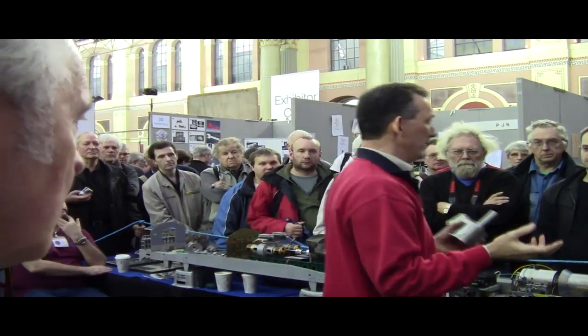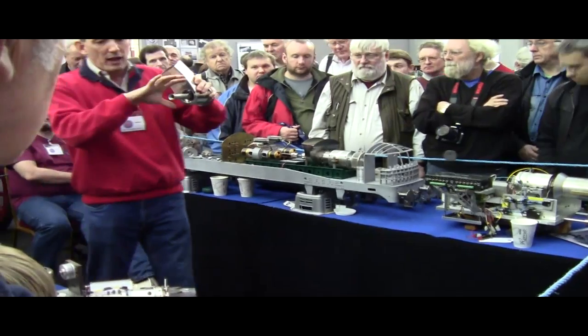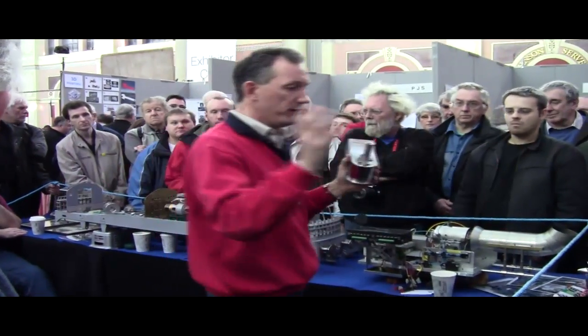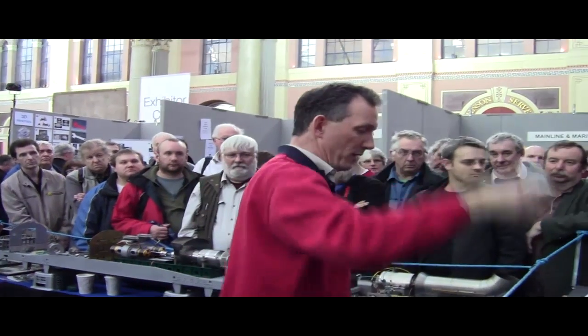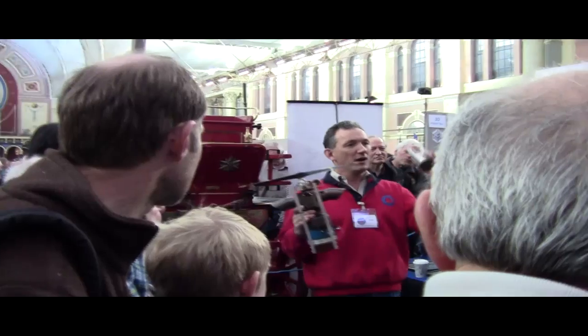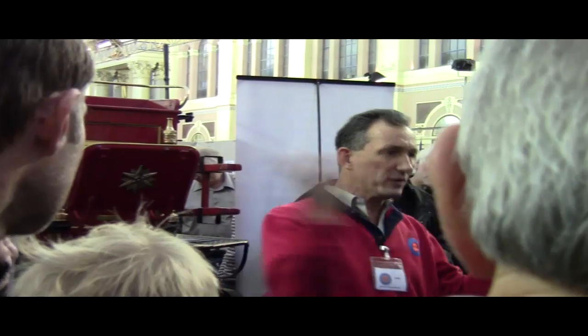Once we've converted it into shaft power we can do what we want with it. With a gearbox on the front end — there's an example of the gearbox on this locomotive here — and a propeller, this is the original prototype built back in about 1998. A 5-to-1 reduction gearbox ratio turns this jet into a turbo prop. As a jet engine it produces about 14 pounds of thrust and weighs about one and a half pounds. In the turbo prop configuration, by converting all that hot high-velocity gas through the free power turbine and putting it on a propeller, we get 50 pounds of static thrust — five-zero. We've taken all that energy and are now using it much more economically and usefully.